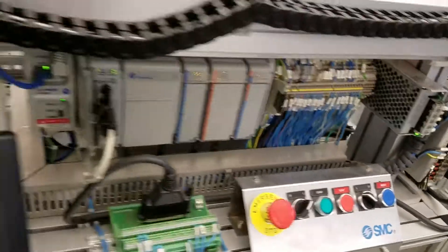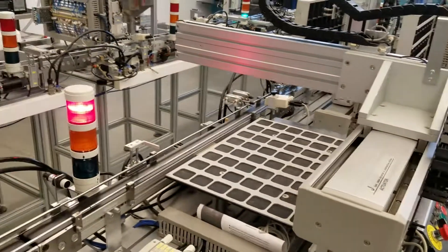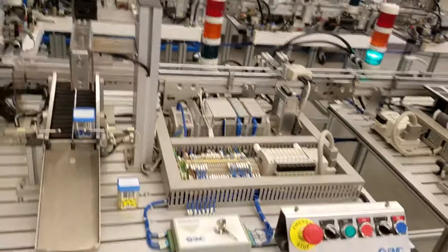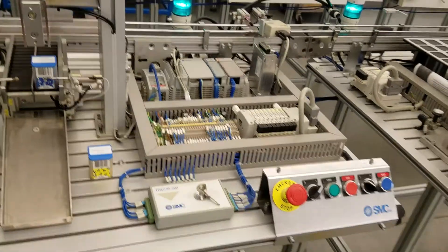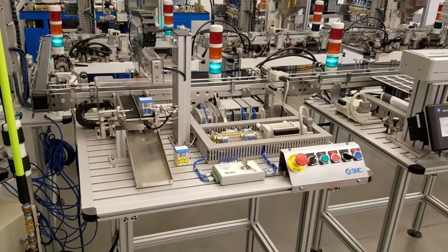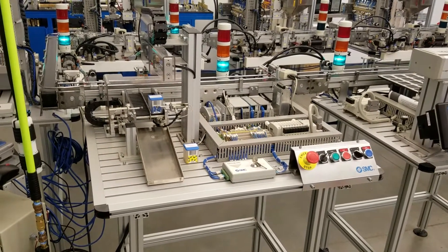Station nine finding its home position seems to do fine — you don't have to do any pushing on the actuator. It's red because it's still in the process of getting initialized. There it is — ready to go. Station ten is just exactly like the other stations one, five, and six. You just turn the power switch on and it's ready to go, and the emergency stop sequence is the same on that as well. So there's your overview of starting up each individual station. We're going to continue in the next video talking about observing the sequence of the actuators on a given station. Stay tuned.